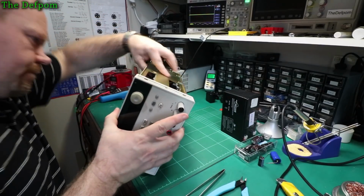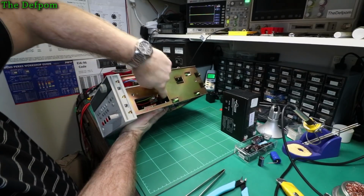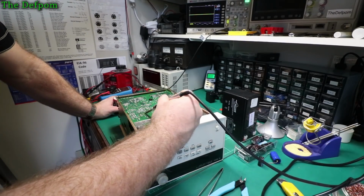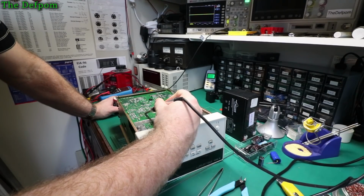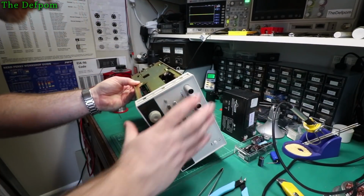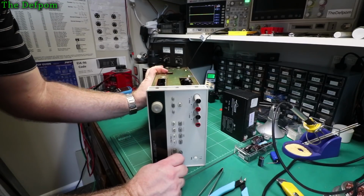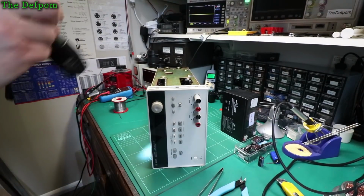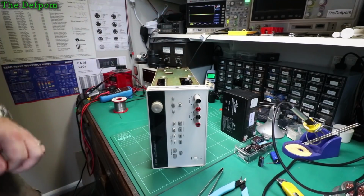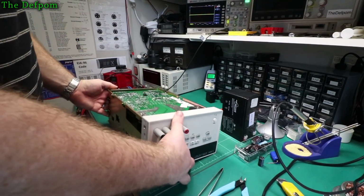Now, it just goes in there. Right. I'm trying to get a side view for this. So there's the cap that's there. Again, we'll try and get the heat through the board so I can actually solder on the top side. Trying to see if I can actually see into the top side there. Maybe I can solder directly on the top side. Get my iron in the gap. I'm not sure it's flowed through. It needs to. No, it's flowed through a little bit. Just a little bit. Okay, well, let's cut those legs off and give it another check and see what happens.